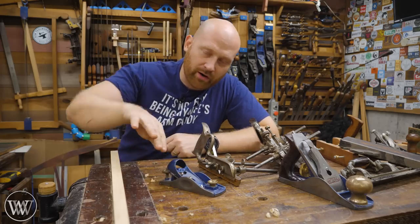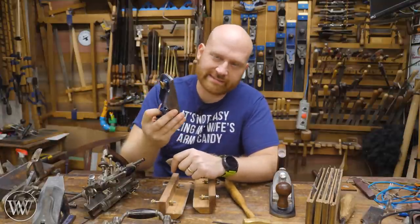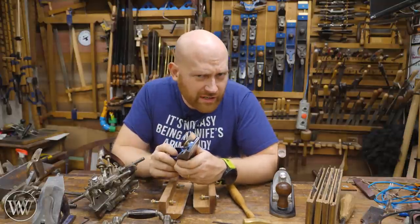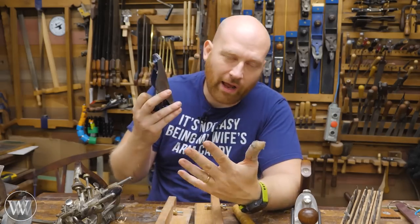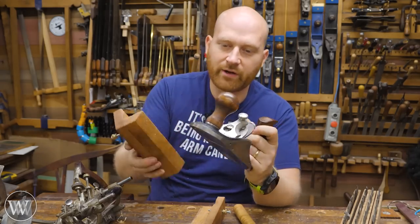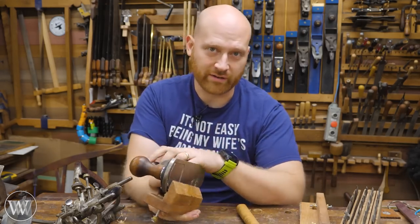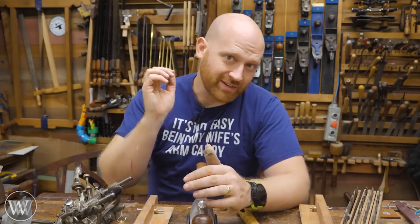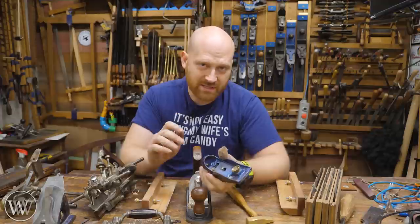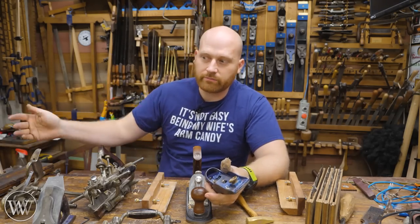You may want to come back and sharpen things up with a card scraper on the rounded corner, or do something more detailed, but in general that's all you need. For perfectionists, freehand will never be perfectly accurate, though you can get it visually very close. If you want exact chamfers, you can make wings that attach to the side of a plane to turn it into a chamfer plane — I made a video on those. You can also buy molding planes with a chamfer or roundover profile built in. This is one of the places hand tools really shine, because setting up a router takes far more time than just grabbing a block plane or a molding plane.